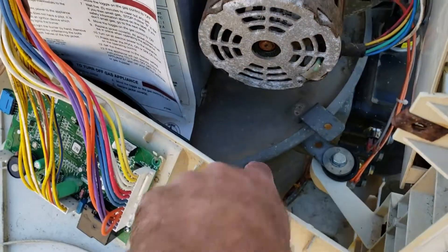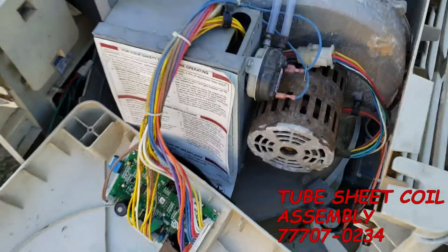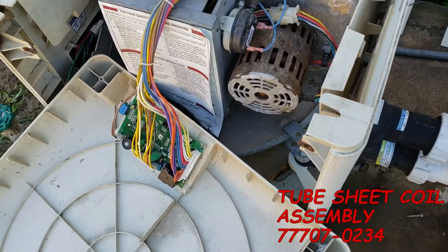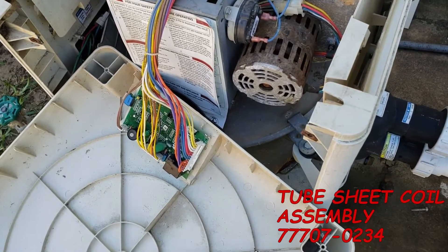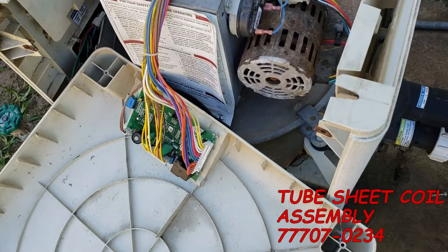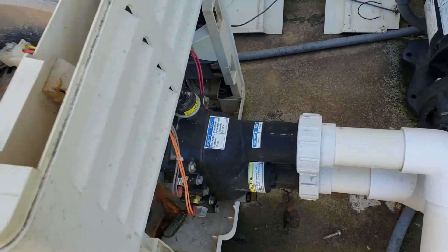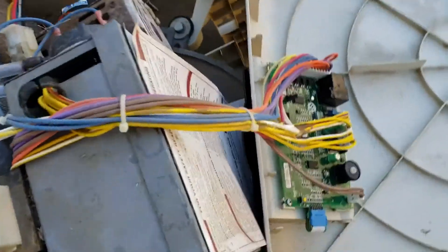I had one case where the AFS light came on and it wasn't anything to do with the airflow switch itself. It was because the heating coils down in the combustion chamber had water leaking out of the pipes, and it filled the combustion chamber with water — I have a video on that repair in my channel. That was what was causing the blockage of airflow, not the airflow switch itself. Same thing with your water switch: it's probably not the switch itself, it's probably something blocking the water flow.